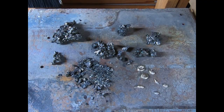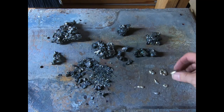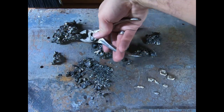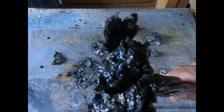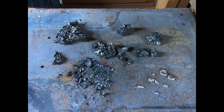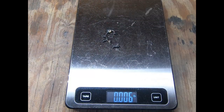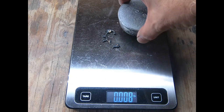After pouring the aluminum, I went back and combined both collections of slag — my first attempt and this attempt — and I cooked all of it a whole bunch more. What you see here is what I came away with. It didn't occur to me until later that I was trying to reproduce something I had seen on another YouTube channel but that I had skipped a step. When Jason of Mount Baker Mining and Metal smelts his ore, he always includes a collector metal, and I didn't. So is that why there is so much visible metal suspended in the slag? I wonder — should I have dropped the aluminum in from the start, similar to what I did the first time around, but just cooked the whole thing longer?